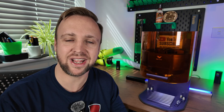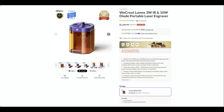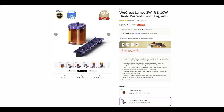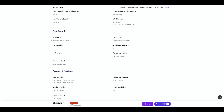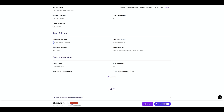Let me tell you about the specifications. Starting with price — $1,299 is the starting price for the base product. There are various tiers: one with the slider, one with the slider and the rotary and the extraction. I have got the slider. Specs: 10 watt diode, 3 watt infrared, can cut 6 millimeters, engrave up to 4,000 millimeters per second, working area of 116 by 116 millimeters. Comes with an HD camera, autofocus, very fine spot sizes, high precision, 8K resolution. Compatible with WeCreate, LightBurn, and can connect via USB or Wi-Fi.